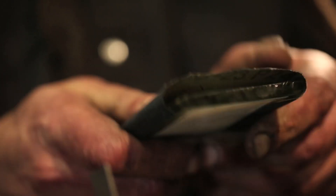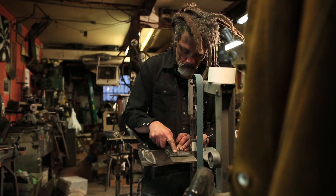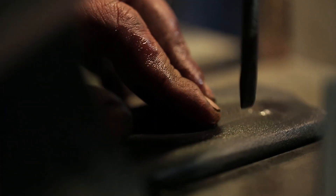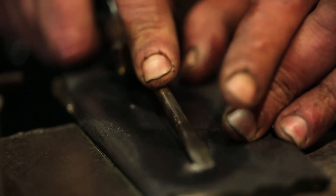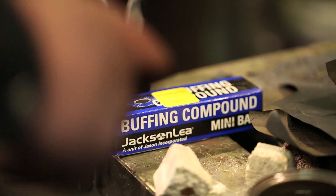Take sandpaper and put it on a perfectly flat surface — I used a piece of glass with the sandpaper glued on the back. Using different grades of sandpaper, first getting the shape and then finer and finer, refining the blade until you have a blade that is kind of terrifying.